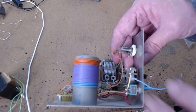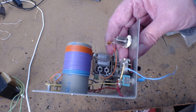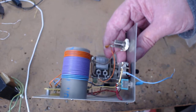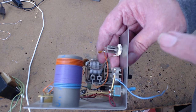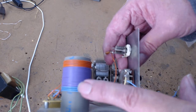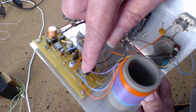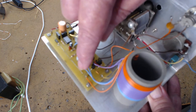Okay, an oscillator is basically an amplifier with feedback. If you take an audio amp with a microphone, and you bring the microphone near the speaker, you'll hear feedback. It'll go into oscillation. That's what the regenerative set wants, and you want to be able to control that with the regenerative control, okay? So if your radio doesn't oscillate, first thing you want to do is put a black mark on the wire and the spot it's been wired to, and then unsolder them and reverse them.